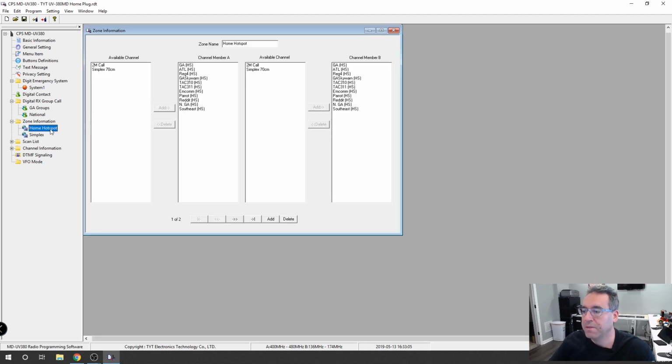A zone on these, I have this one named Home Hotspot. What this is actually doing is breaking my channels up almost into radio configurations. So here I have channel number A, channel number B. As I mentioned earlier, we have an A and a B, a top and a bottom, a 1 and a 2, depending on how you want to word it. And it can listen to both, and you pick which one you want to transmit on. So I have my home hotspot defined so that every channel that has an HS in the parentheses, and this is going to make a little bit more sense in a little bit, is a member of the home hotspot zone.